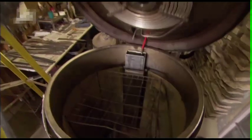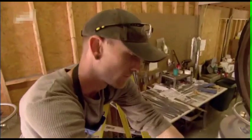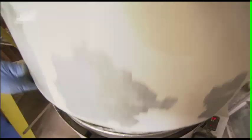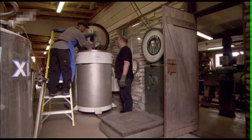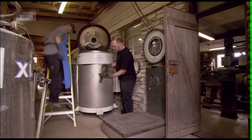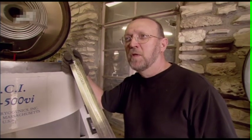So Dan uses a computer controlled cryogenic freezing unit to tighten the steel's molecular structure. Over a week, the sword will be chilled to minus 184 and then heated to 232 degrees Celsius over and over again until Dan thinks the steel simply can't get any harder. What we're doing is combining classic hammer, anvil, fire and sweat with 21st century metallurgy to make a super sword.